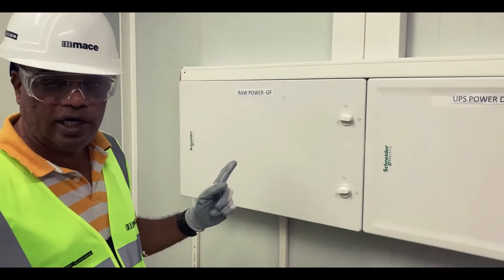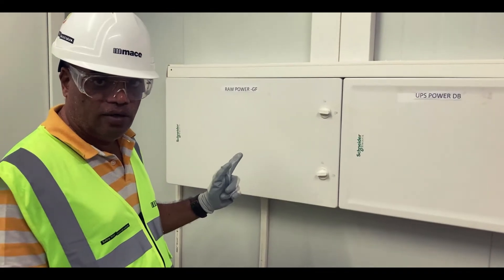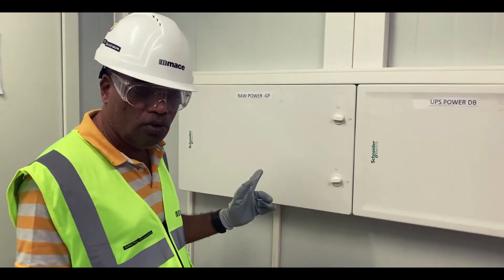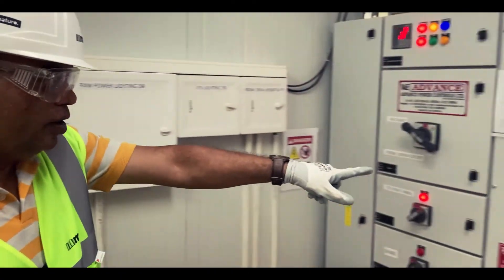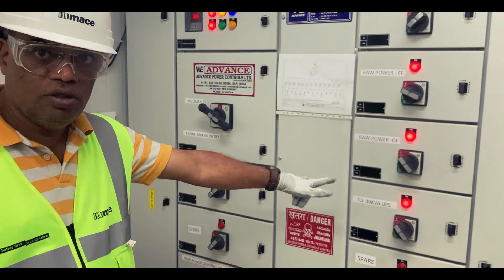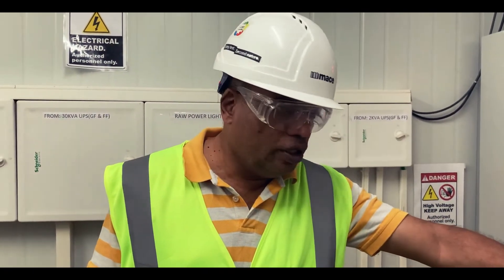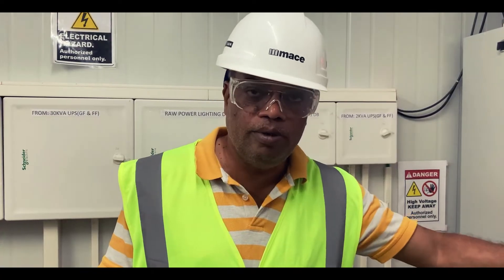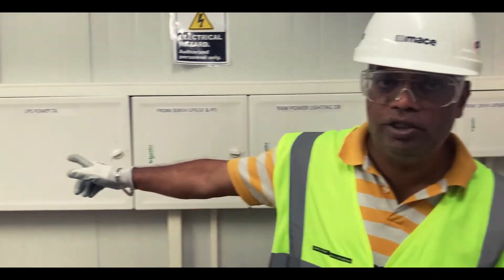Here we have found a rectification at the point of work which needs to be rectified, which will be done by my trained electrician Mr. Naresh who has been assigned the job. Since this is the main panel, we are considering it as the point of isolation. We will be using the proving unit ensuring that the energy is de-energized and implementing the full LOTO process by applying a lock and a safety tag before executing the job.